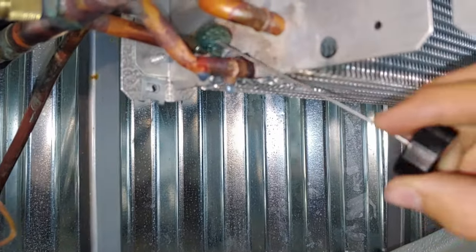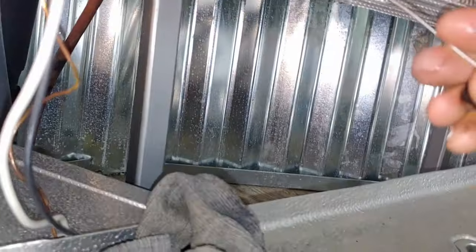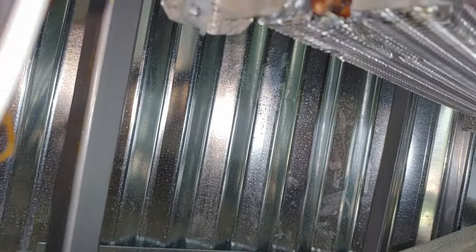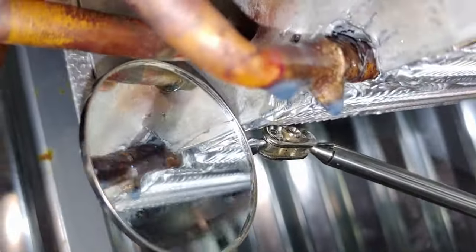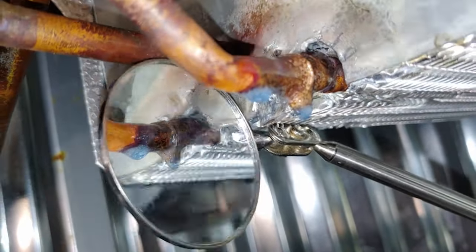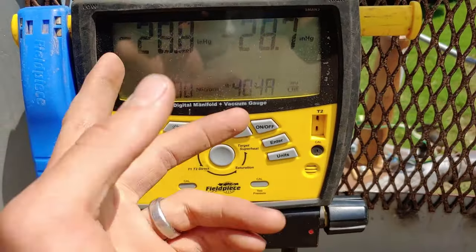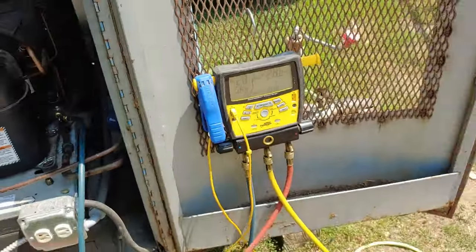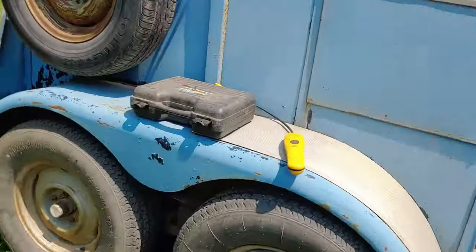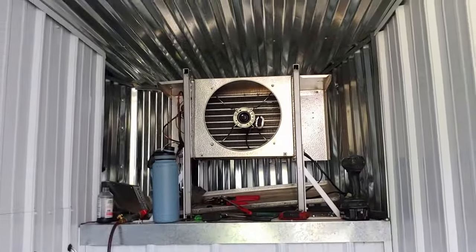We'll pull a vacuum on it, but first I like to put about 10 psi into the system and do a heavy soap-down before pulling vacuum for 30 minutes — it really saves wasted time if you accidentally miss a spot. With that pressure in there we should be able to see if there are any leaks left. The deep vacuum method will tell us the truth. The gauges are saying 28.7 — they might need recalibration since complete vacuum reads 28.7 or 28.8 on these rather than 29.9 — but the microns are stable at 699. I want to get below 500, so I'll let it run a while longer, but I'm pretty confident we've gotten rid of the leaks and the system is actually pretty dry.